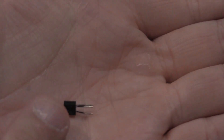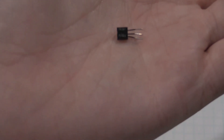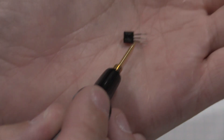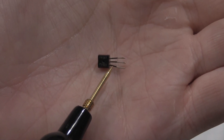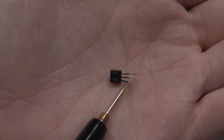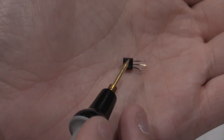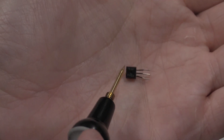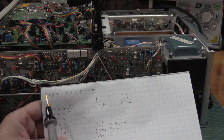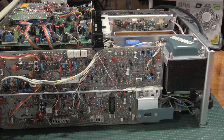One of the other ways I was told to identify these is by looking at the legs of the component. This is actually tarnish — not paint. This particular transistor has a round leg with tarnish where the socket was not. I was told 100% guaranteed these were bad before I personally did the testing and put it on video — I wanted to make absolutely sure before making that claim. However, in this scope, this particular transistor number 151-0367-00 has a 100% failure rate. All of them were bad. All 13.